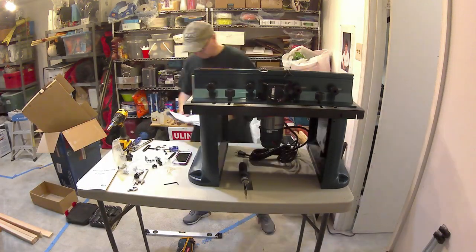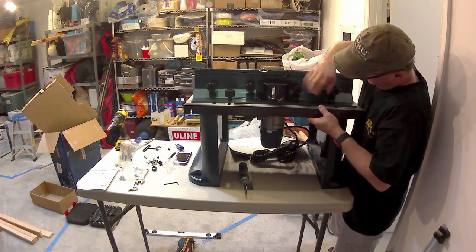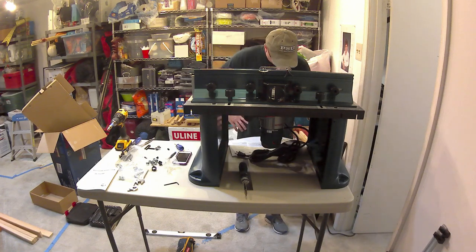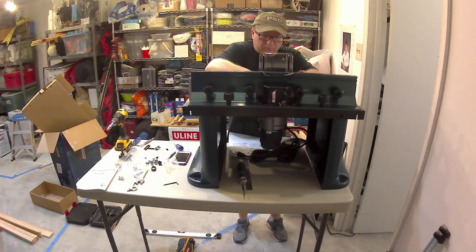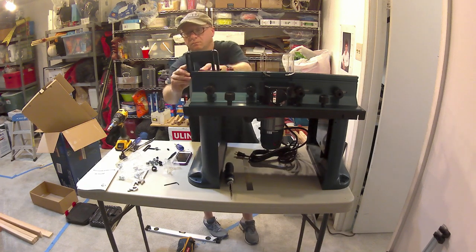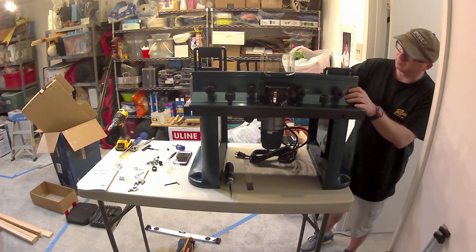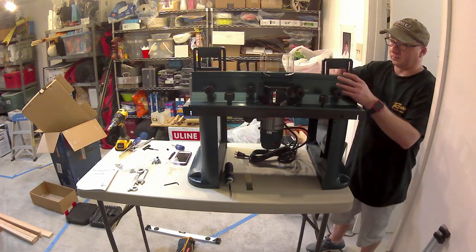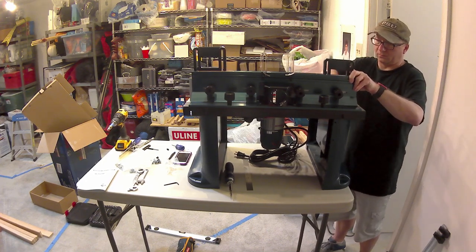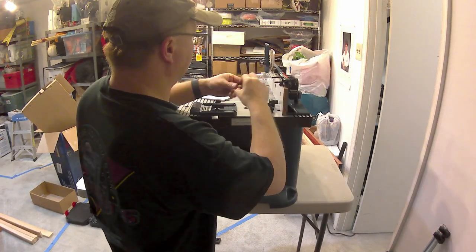Now that the fence is attached, I'm finishing installing the bolts that allow the fence to slide back and forth. I had put them on previously and forgot to put the washers on, so make sure you do that. Then you slide the fence back into place and get ready for the feather boards. I attached the feather boards to the face plate of the router — they're just temporarily pushed to the top. I ultimately took them off since I didn't need them hanging there, but I wanted to confirm how they fit.